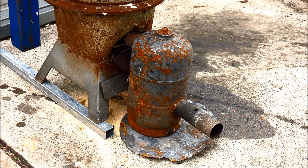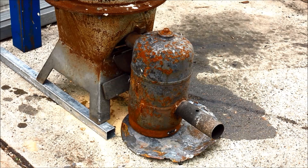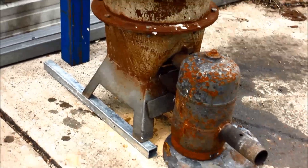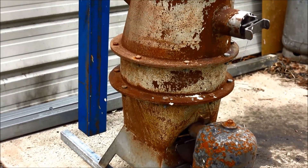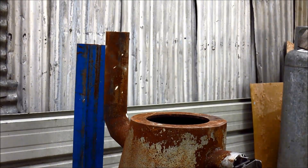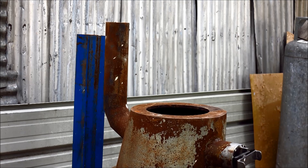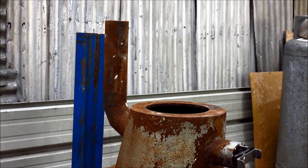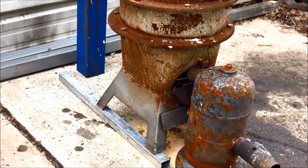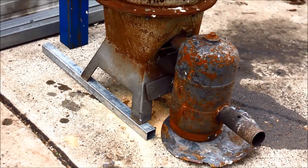There's the 300 kilowatt burner. As you can see, the throat of it is just sticking inside that heater there. I've put a little bit of old tin underneath it just to give the concrete a little bit of protection — it's been raining a lot lately so it might spall. And I've got that bit of blue square tube on hand just in case the chimney needs lengthening a bit. I'll just slip it right on over — might get it up nice and close to the neighbours and they might like a bit of heat.